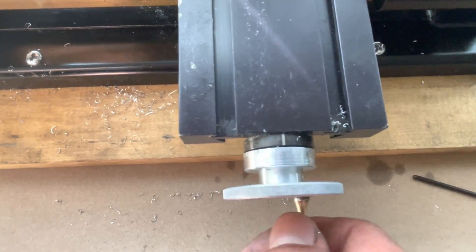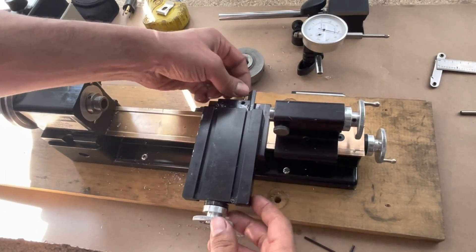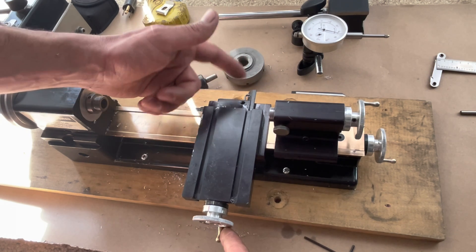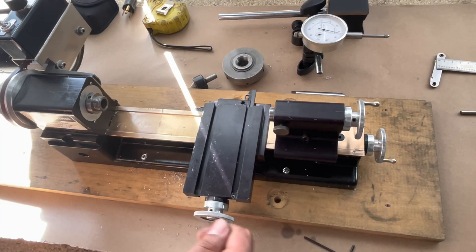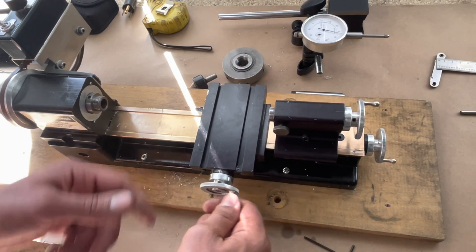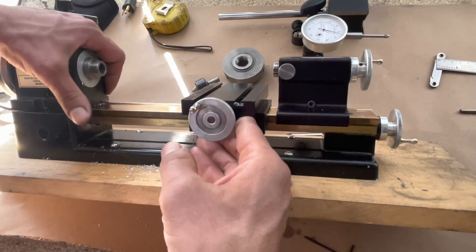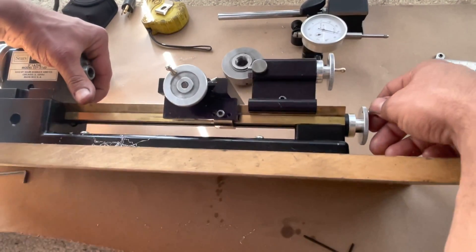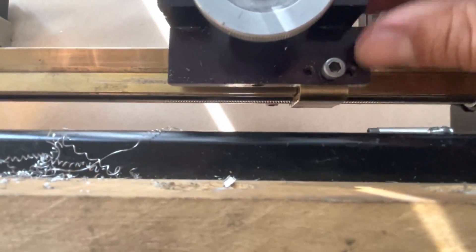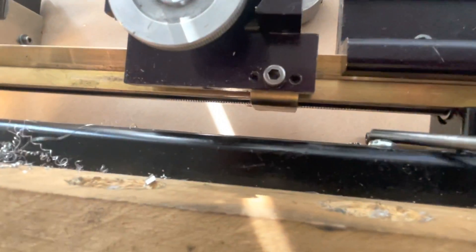Now these are the shims, but they're plastic. I wonder if I make one with brass whether it would make any difference. They're kind of rough or hard to work with sometimes — it just depends. It's only connected with two screws, and that's another reason for the backlash problem.